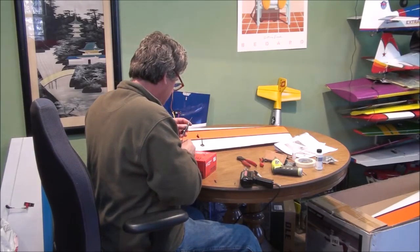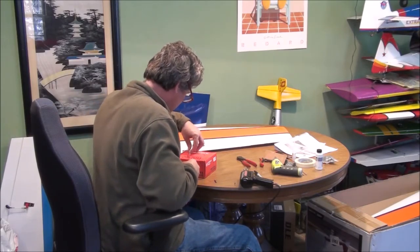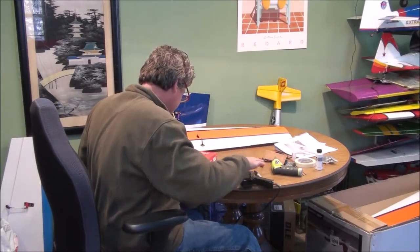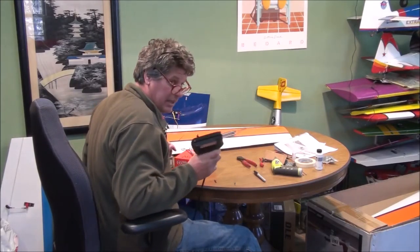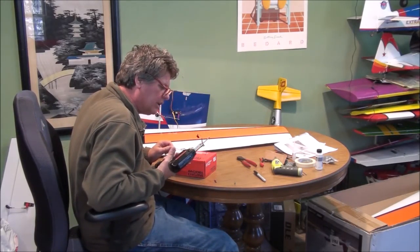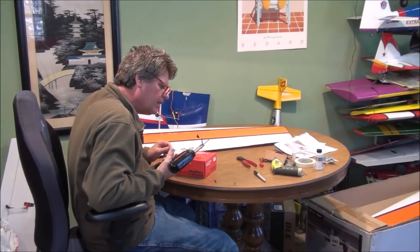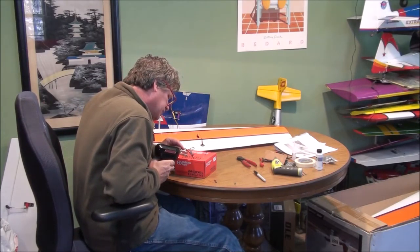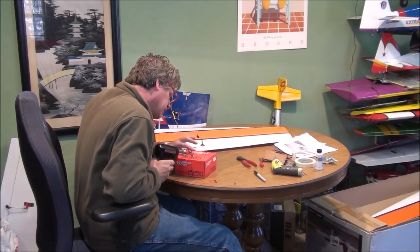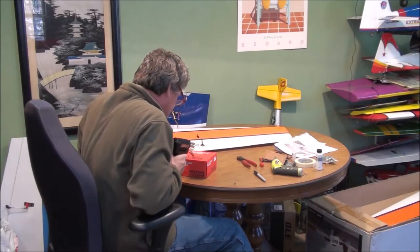I put it over the box. Heat up my gun, get it good and hot — I usually watch until it starts smoking good. It's getting hot. Heat up my surface a little bit with a very small amount of solder. We call this tinning. Try to do that, heat it back up.